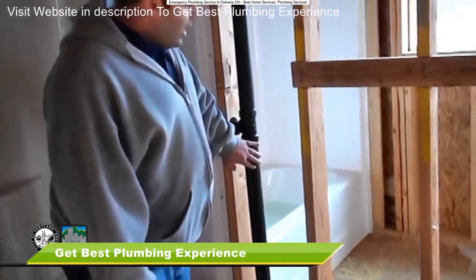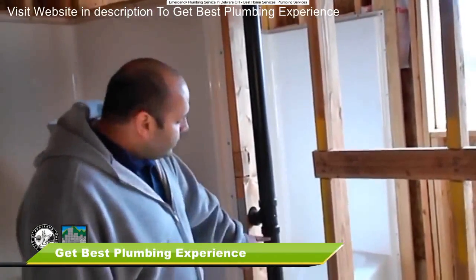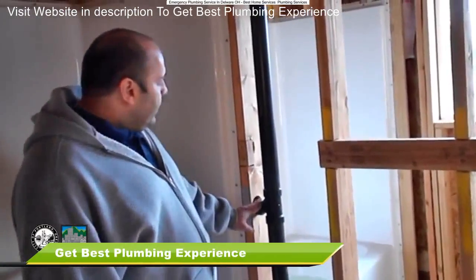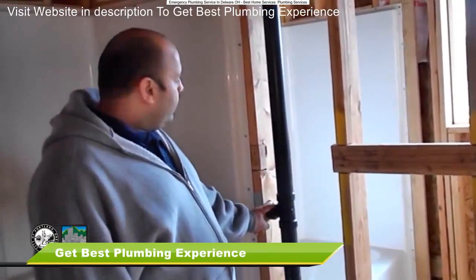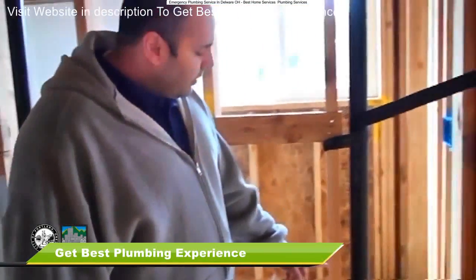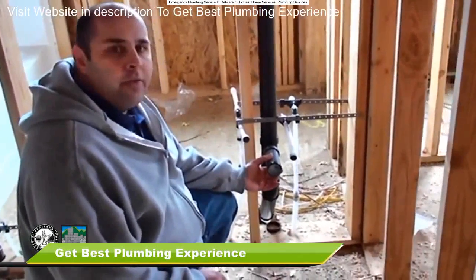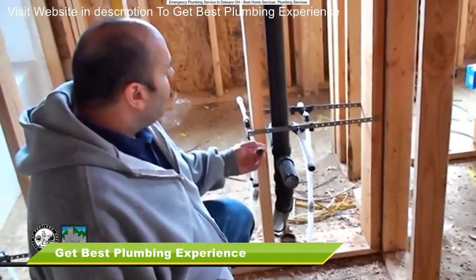Then we're going to follow this vent up. If you notice in this situation, we do not have a wet vent situation. This is just the vent for the toilet. This vent here ties in from the shower, or the tub shower next to it. As we move across, we're going to look here. Here we actually have our drain line for our bathroom sink, the hot and the cold.